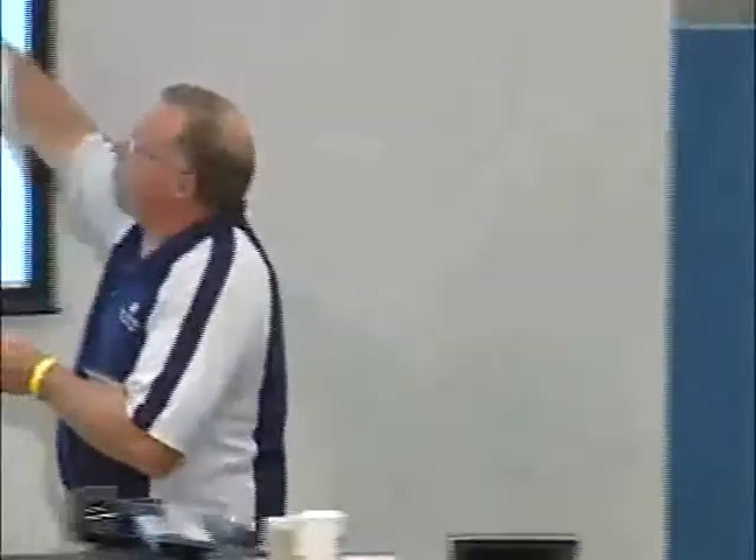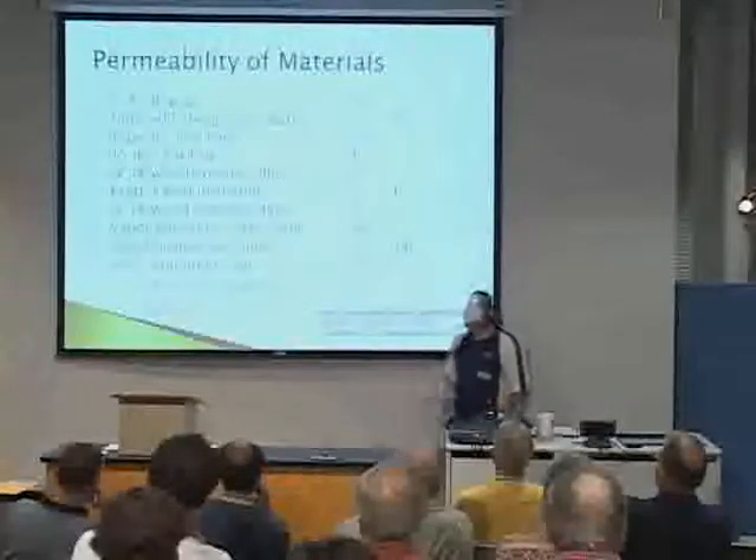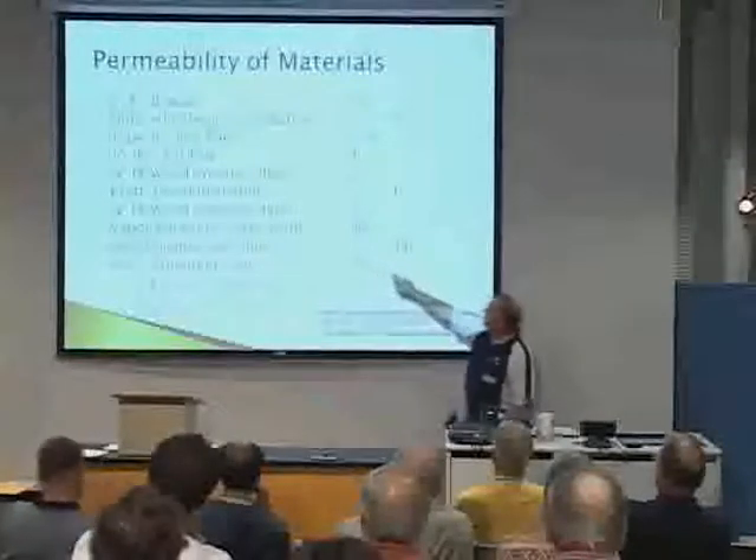You're looking at structural integrity, warmer corners, a better-built house. I threw this slide in to show you what permeability is — that's the ability for vapor to go back and forth through a material, to let that wall dry out. Aluminum foil is about as close as you could possibly get to stopping moisture. What's on the outside of some of these insulation boards on the outside of the house? Aluminum foil. So what's going to happen when that moisture gets trapped in the wall? It can't get out. Any of these aluminum things — like radiant barriers — I don't believe in them.